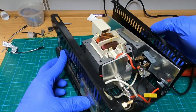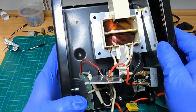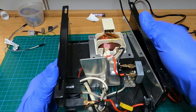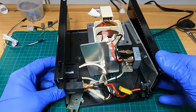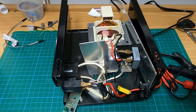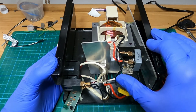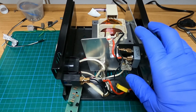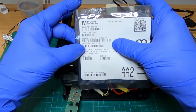This charger, although it is made of metal, doesn't have a ground connection, and the only protection is something here. There is not much usable information on the web about these chargers, except at EEVblog — link in the description. Someone even bothered to reverse engineer it and has a schematic, although that one uses the SS8050 instead of the 2N5551.